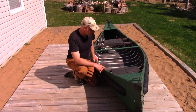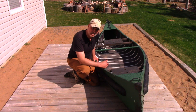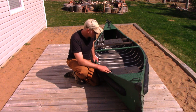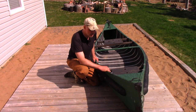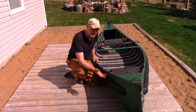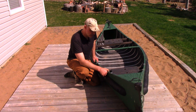They're very light. In spirit, they're very true to the tradition of the birch bark canoe. There are many aspects of how these are constructed that are similar to the birch bark canoe. Of course, they're not the same thing, but they're similar in a lot of ways. If you've seen a birch bark canoe go together, and you look at the ribs and the seams, this thing has ribs. It's got certain kinds of seams that are not unlike a birch bark canoe. It's almost like someone decided to make a birch bark canoe using space age materials: various kinds of caulking instead of spruce pitch, aluminum instead of birch bark, and rivets instead of spruce roots to tie it together. You get a really light, really tough canoe.